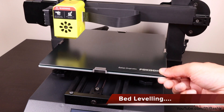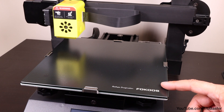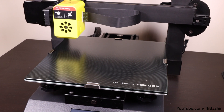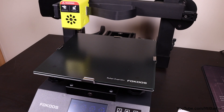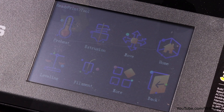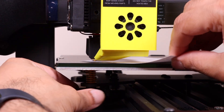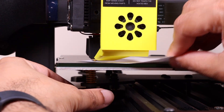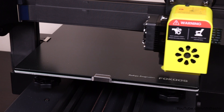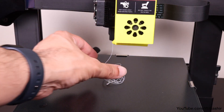One issue with the Odin 5 is bed leveling. Many printers now have automatic bed leveling, and it won't take long to envy those with that feature. The Odin 5 has assisted manual leveling, meaning the printer moves the print head around the bed while you turn the adjustment knobs beneath. To do this, press the home button to reset the machine's zero point, select the leveling button, then select any of the four corner points. Slide a piece of paper between the nozzle and the bed and adjust the knobs until the paper just catches on the nozzle. Continue until all points are dialed in, then load filament — a quick and easy task — and you're ready to print.